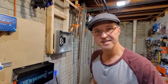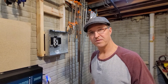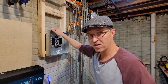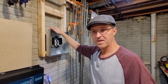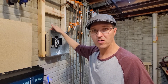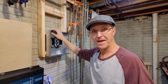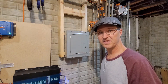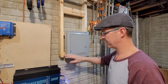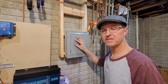I'm going to put the cover on to see how it looks, and then I'll probably start doing something else tomorrow because I realized I haven't punched any holes out yet and I don't have any wire brackets to protect the wire from the sharpness of this case. So I need to go back to Home Depot and pick those up. This is it for this video — in part two I will be wiring up the panel to the inverter and also probably wiring in my first circuit.